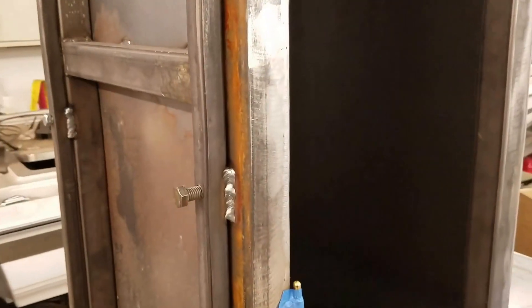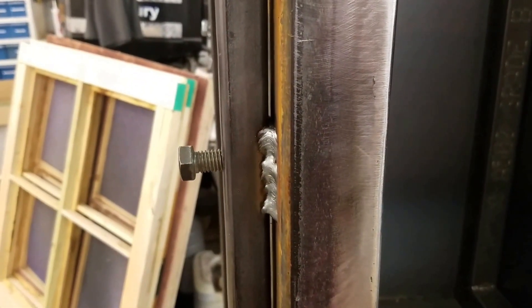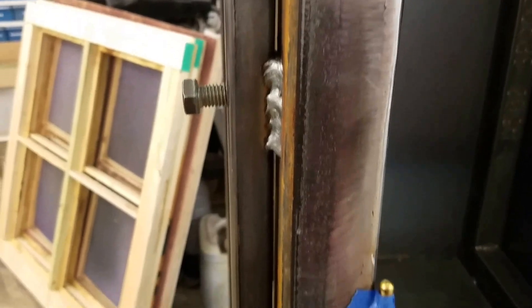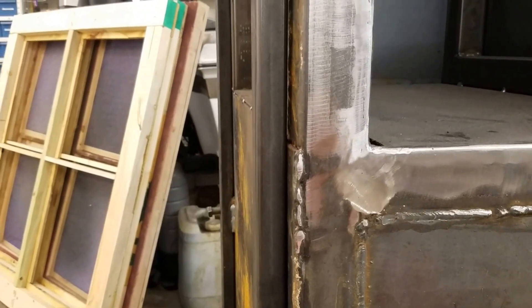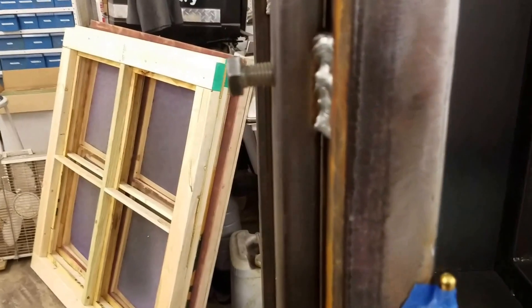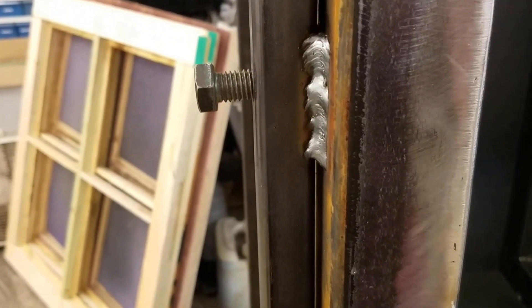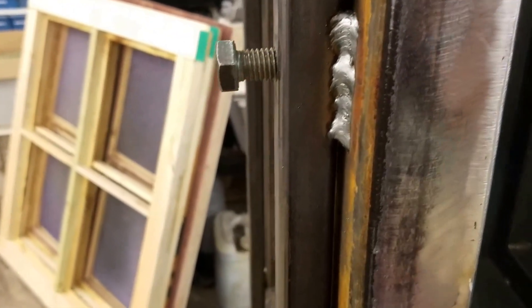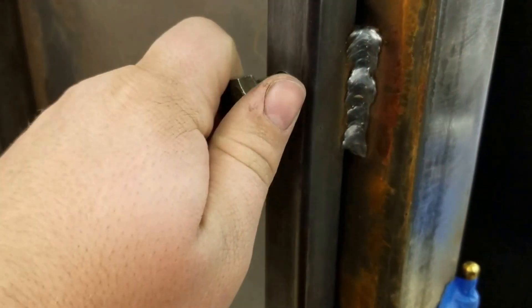We've got little spacers where the welds are. See if we can barely see some daylight right there. The reason you see daylight is because down here on the bottom side of the smoker we've got a piece of 11-gauge holding it in, but where the table is we don't have anything. So where these bolts are — which are just in there temporary right now — we've got a piece of 11-gauge between the 1-inch and the 2-inch, and it's just a half-inch nut that slid in there. Fits perfect inside.